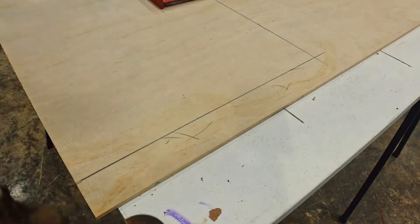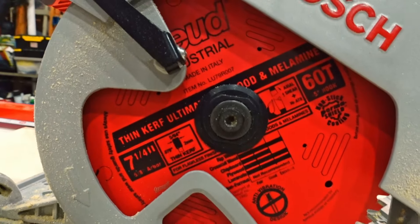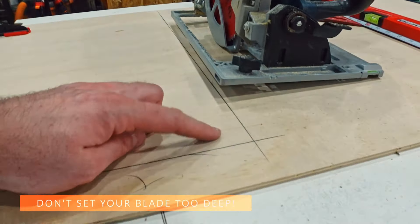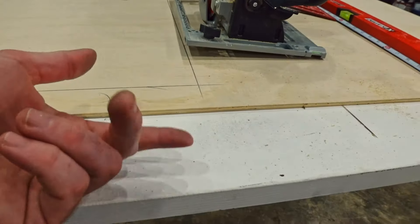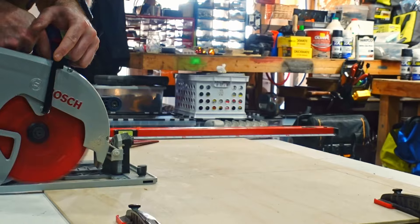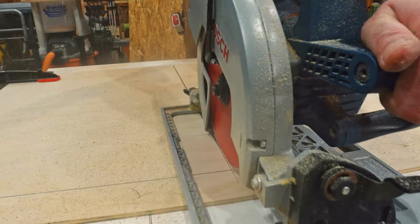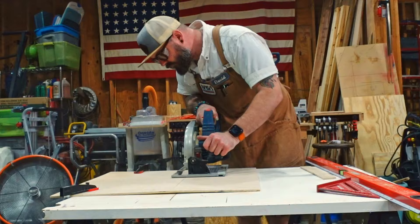To make the cuts I'm using my Bosch cordless circular saw — this one is their 18 volt — with a seven and a quarter inch plywood blade by Freud. I'll have a link down in the description for both. For the blade depth I want it just thicker than the plywood so I'm not blasting through the old doors I'm using as a platform. This cut doesn't need to be perfectly straight since I'm just cutting the letters out, so I'll freehand cut and use this piece to make a copy since we need two of them.